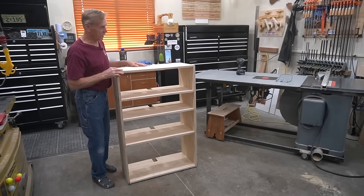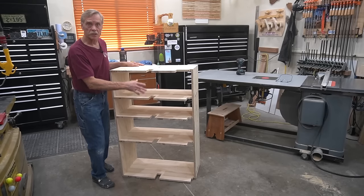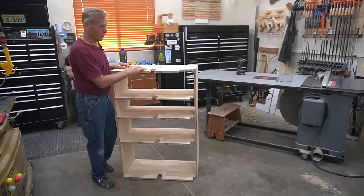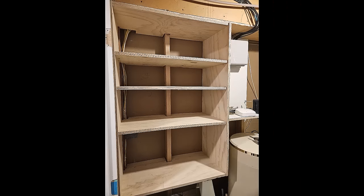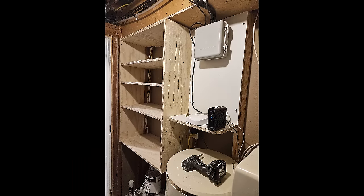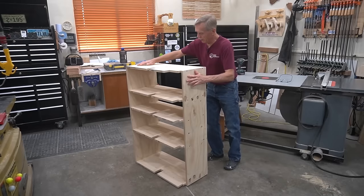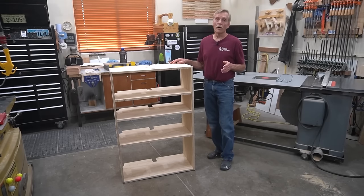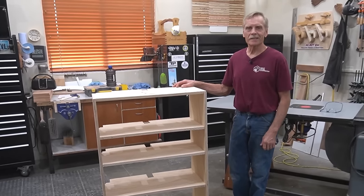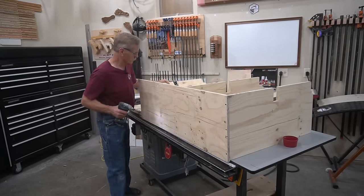After initial assembly of all five shelves between the sides, I took it out to the job site and did some field modifications so that it fits into the framing and around wiring on site. It's a tight little mechanical room where the shelf gets installed between studs and around wiring in the corner. With those modifications made, I brought the cabinet back to the shop to disassemble it, work over the pieces, and take the overall fit and finish to the next level — it takes only a few minutes to zip out all the screws to disassemble for routing and sanding.